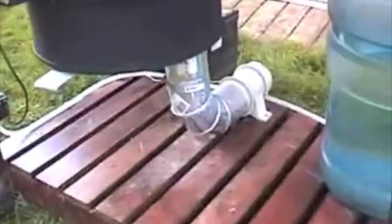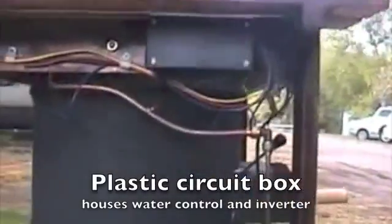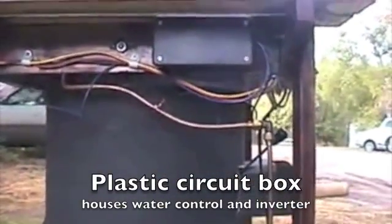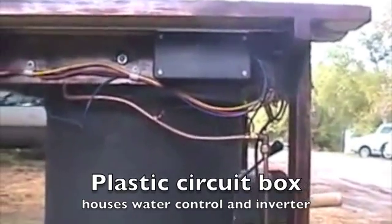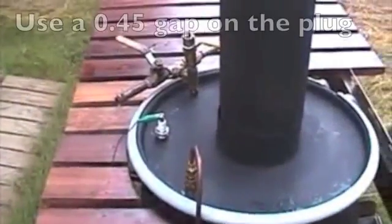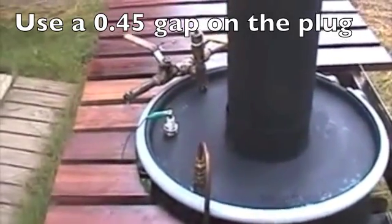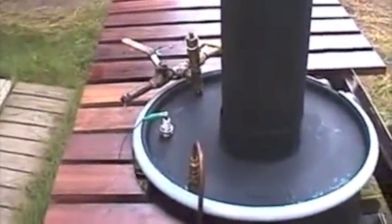Here's some of this in action. There's a fan down here — the fan enters at the bottom. The electronics are up under there: there's an inverter, an amplifier circuit, and a relay to feed the water. That's the feed pump pressure. I ended up using a spark plug, threaded it with quarter-inch pipe thread, and it works great.